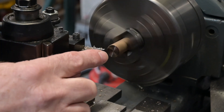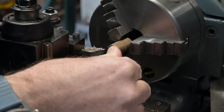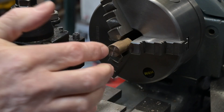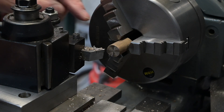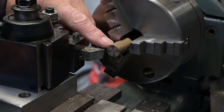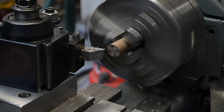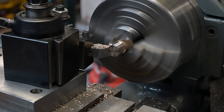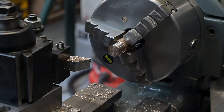Right, I've set the DRO now. I've zeroed the DRO as I've faced this end off, so the DRO is set to zero. If I now come down 0.531, I'll go down 0.500 first and then I'll add the 0.031 on once I get near the dimension, to get the DRO through that. Now it's a risky point - straight on.